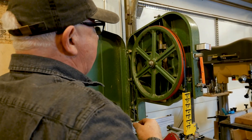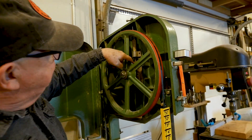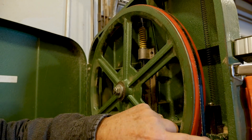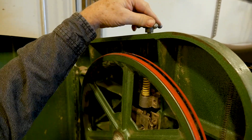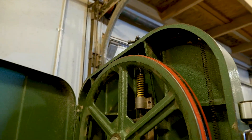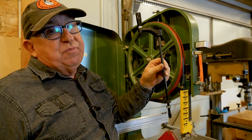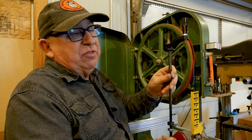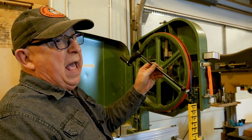Let's open up the top cover. Pretty standard setup on a bandsaw: there's a lifter mechanism that makes the wheel travel up or down, increasing or decreasing tension on the blade. You're cranking this up or down and it takes a lot of turns. Many times you have to get a stool. I found this crank system from Big Horn — there's a link in the description below. It's about a $30–$35 investment, and with some very mild modification you can get this to work absolutely beautifully.